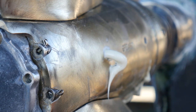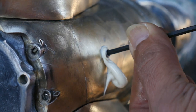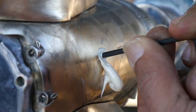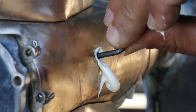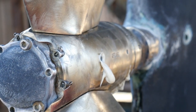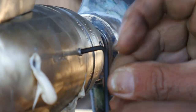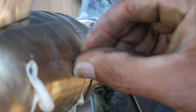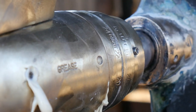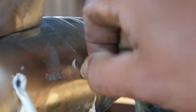The fitting comes out, the original goes back in. We are going to snug it a little bit, but not too much, because once again we are going into bronze. Then we are going to do the same thing on the other fitting. It's a little greasier than it was before, but we are going to put the grease fitting in using a wrench.